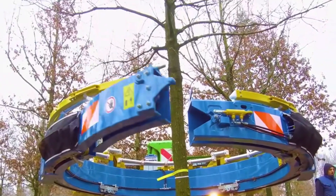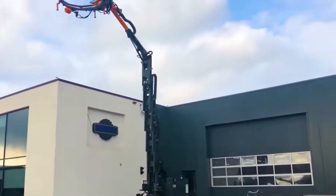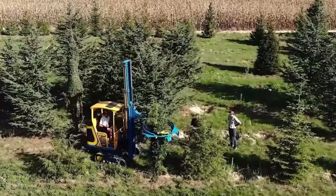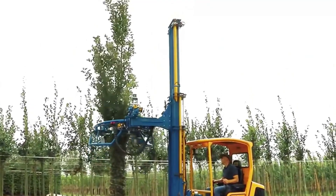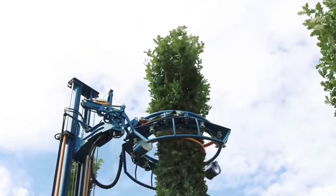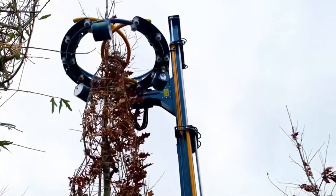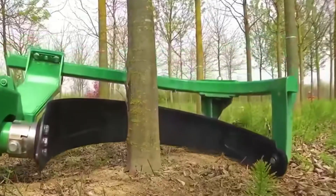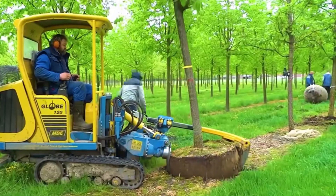After the machine moves to the side of the seedling, the driver controls the direction of the triangular device hanging in front, then opens the embracing ring to hug the trunk. The internal slide pulls the thin wire to tie the branches. The lifting machine can lift up to 6 meters. To prevent branches from not being tied well, two bow-shaped robotic arms are also installed in the triangular device, which make the branches return to shape before wrapping. This ensures every branch is tied. After completing this step, the crescent-shaped tree-digging machine cuts the root of the tree.